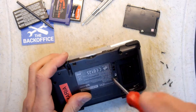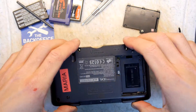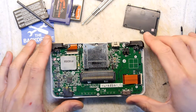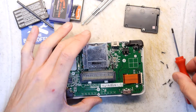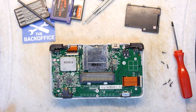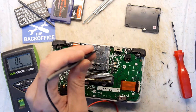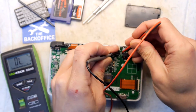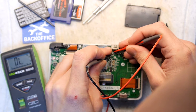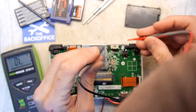There's a screw in there as well, but I don't know if you're really supposed to get at it. That comes off nicely — is that the Wi-Fi module? So the power comes in here, and it looks like there's a diode here and a fuse — look, a fuse. F2. So what we could do is try to see if our fuse is blown. I'm not seeing any continuity through that fuse. Some sort of inductor there. That's a bit of a worry.